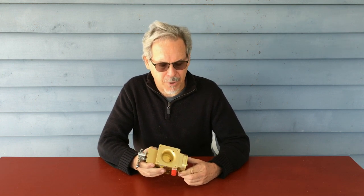These come from good people down under and I've had a really good experience with them. They had an earlier model — the very early models did not have the diaphragm on them. Then they had an external diaphragm, then they came with the diaphragm built in, and then the modifications of the two previously pointed out features. That's what makes this carburetor evolving.